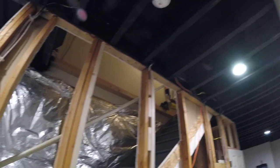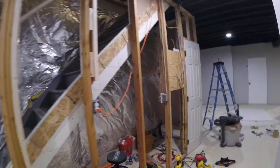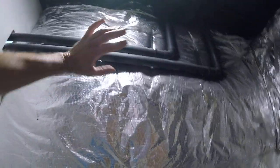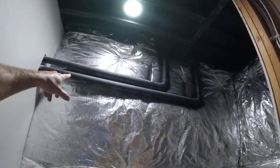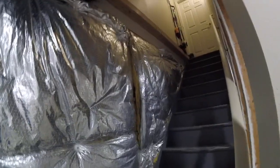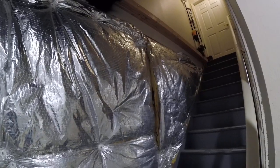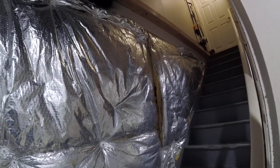Because this is where the wall ended and this is support, I couldn't completely take these out — I had to leave them. So I just worked with what I had, opening up this space. The next step is getting this all drywalled and finished. I've got to do something to cover this back wall without totally hiding the pipes — I still want to have access to my pipes, those are for my hot water heater and the vents. Then something here — I'm probably going to take this off, and I don't know if I'm just going to do drywall right onto the concrete or if I might have to have a barrier in between.